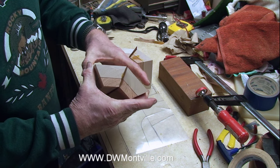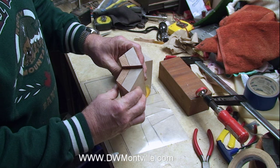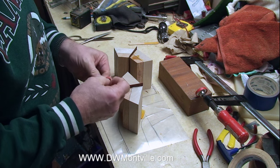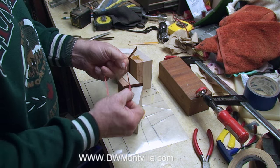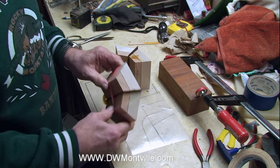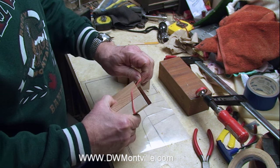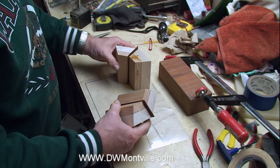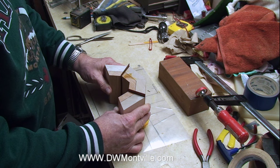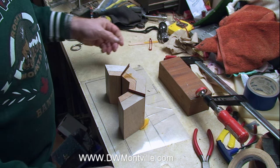When I glued these halves together, because of how short the segments are and the angle, I was just able to put rubber bands around it and hold it together. That works well — you just get a bunch of rubber bands, put them on there, hold things in place for a little while, and the rubber bands will do the trick while the glue sets. But now I want to glue these together, and there is a simple trick to do this with a clamp: you make clamping shoes.